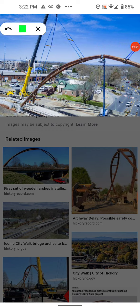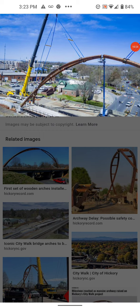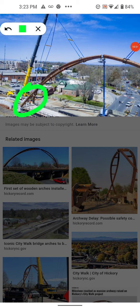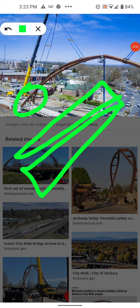There's an image with a split right by one of the abutments. One member, one section — one leg is split like that. This one is still intact pretty much at the base, but this part is split at the base at the abutment, and this one is off in the air with a split down it. Makes me wonder — could the cable have caused it to buckle, split? Could the loads going down have caused a fracture in this member, which could cause a fracture and help it rotate?